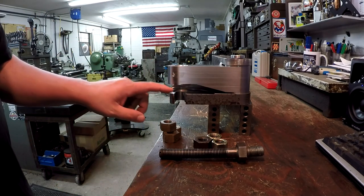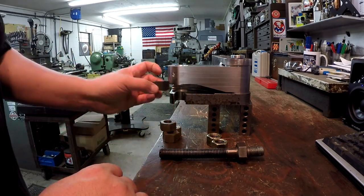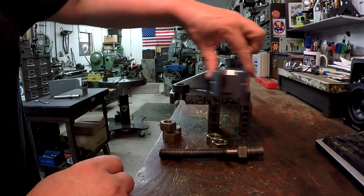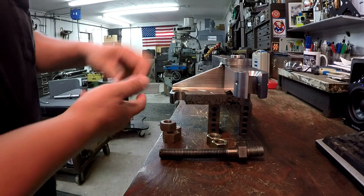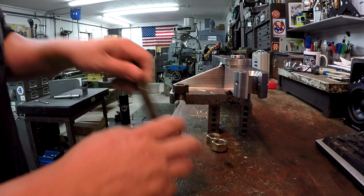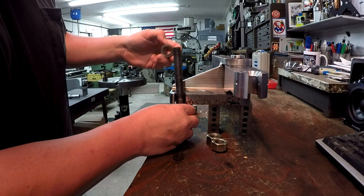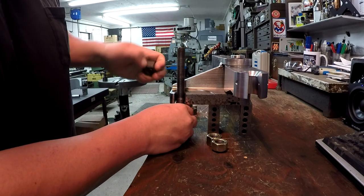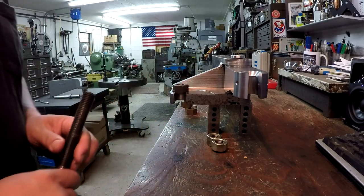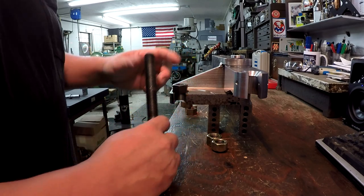One of the reasons behind it being like this - you have a gap here, and that's for this nut here which actually goes up in there. Once it's swung in place, I'm going to move this out of the way so you can see. That's what this counterbore right here is for. This nut, once it's installed - this rod is going to be through here like this, and this nut will be down here and you actually lock it in place right there. That counterbore is to allow this to not be able to come out at all.